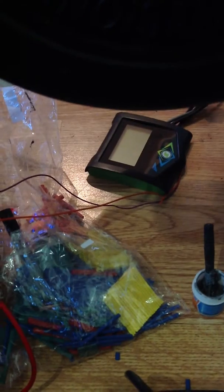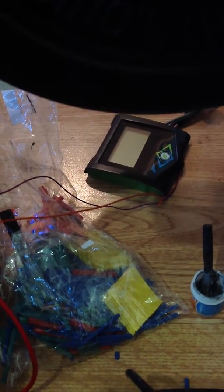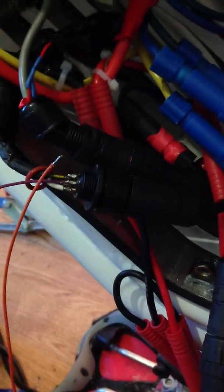So I tested the outputs here with the multimeter and they were changing when I was spinning the wheel, so I knew they were working. I then tested the power and that was 0.70 volts coming out of the controller. So I've taken a 5 volt positive feed from the USB port connector on the motherboard of the display and run it up to the Halls input.